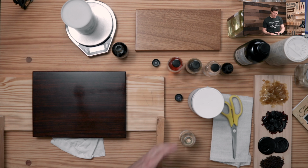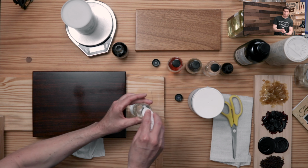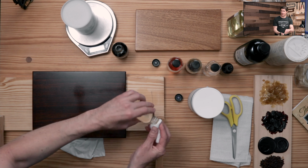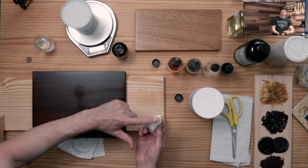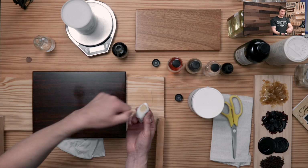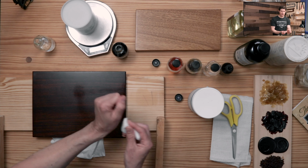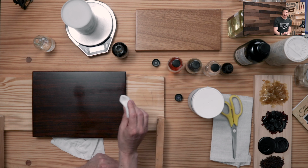And then after the shellac is clear, then typically I'm gonna take a whole swig. I call this a swig or a shot. So then I'm gonna just do that. You saw that I cleared it with just a fingertip of shellac, but then I'm throwing a big slug of alcohol on there. So we're getting a lot more alcohol than shellac. That pumice is gonna be in there and the pad's gonna be pretty wet.